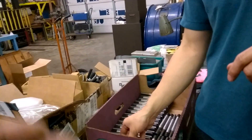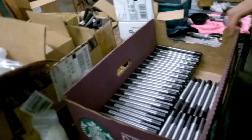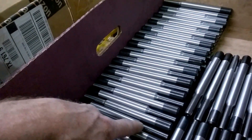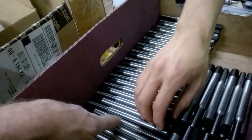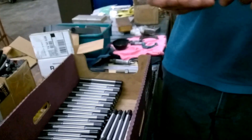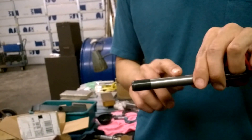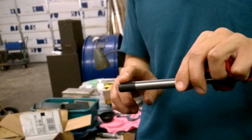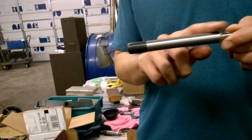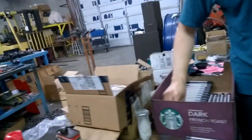This is actually the beginning of the next level right here. This is going to be a state of the art product. So after roll threading, we actually hold it again here to make sure that it's all concentric, because we just machined it. We hold here, then we turn this down with the five-eighths. Then when we're done, we actually hold both ends and turn it down, and finish the center part, so that way everything is straight all the way across.